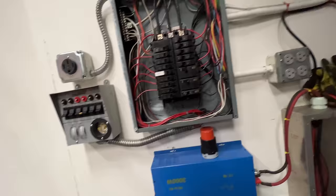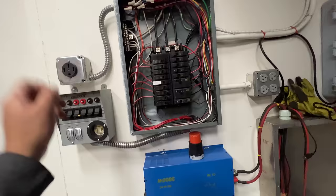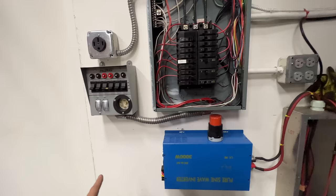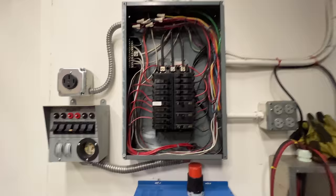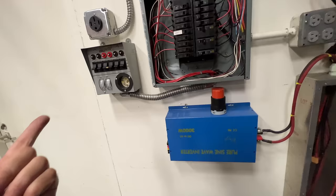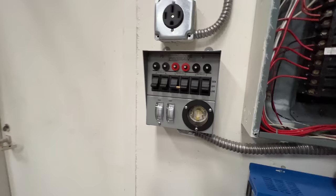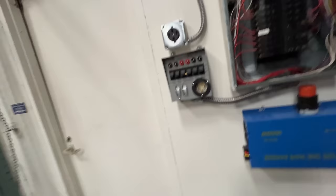That's a safety feature so you don't back-feed into the grid, because that's dangerous. In reality, it would most likely kill your equipment. If you have something connected here and it somehow back-fed into the grid — even if the grid is not electrified, it's going to overload your equipment. If the grid is electrified, it's going to fry your thing because they'll be out of sync. This is a 3,000-watt inverter, and what's on the other side of those three phases is more buildings with more loads — more than 3,000 watts — which would overload the inverter and exceed the maximum any of these little circuit breakers could handle.